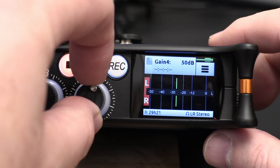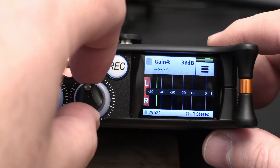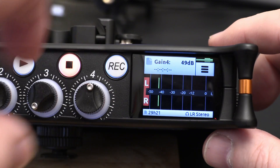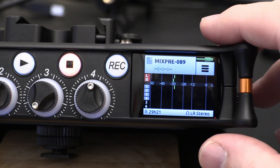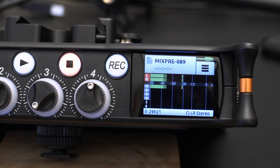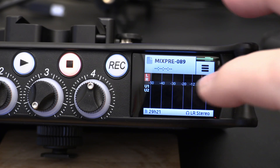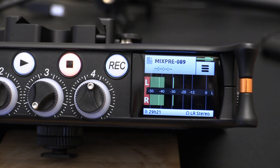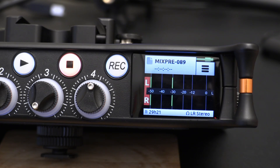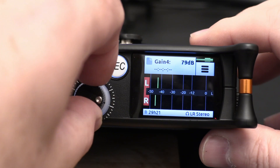The gain options are causing a bit of confusion. When you're in basic mode it's all simple - you turn it up and down, and however many inputs you have, this records onto a two-channel stereo mix track. There are no ISO tracks recorded in basic mode, presumably to keep the file simple rather than providing a multi-track WAV file. The total gain is 96 decibels, all on the one dial in basic mode.